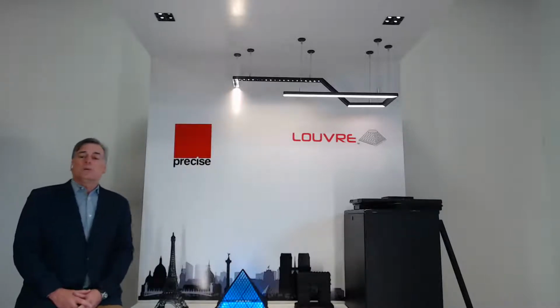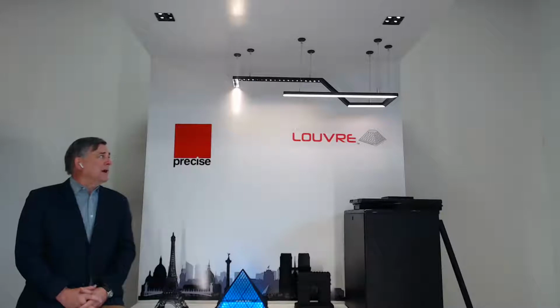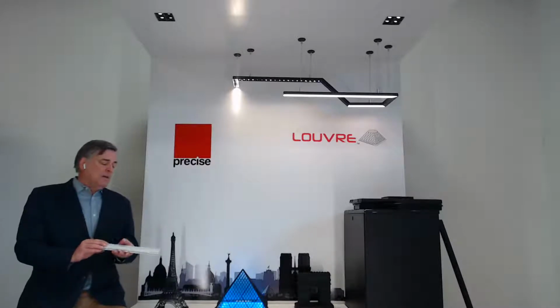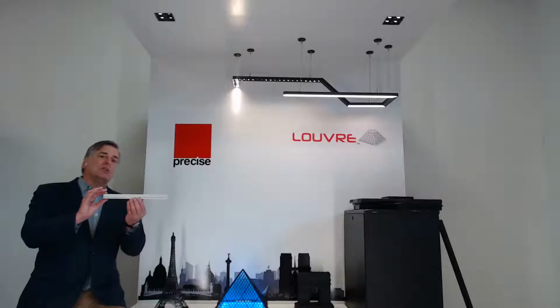I'd like to start off with a little reminder about Precise LED. We've added a few new products to our Zen Light line, and we're going to talk about those today. But first, as a refresher, how we created Zen Light and what makes it significant. First of all, it's a linear line of light. It's the depth of 5/8" sheetrock. What sets us apart from many other manufacturers is that we have a patented channel that accepts standard mud plate, which means as this fixture is recessed into a wall and gets mudded in, there's no metal surface to heat up, expand, and contract, and therefore crack the paint and the joint compound.